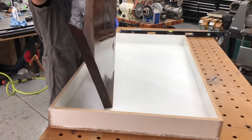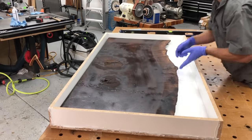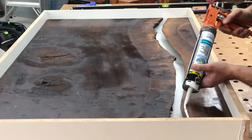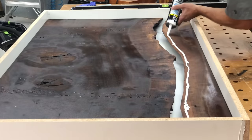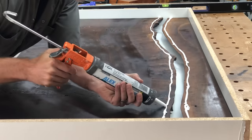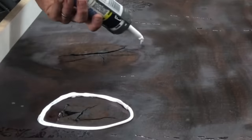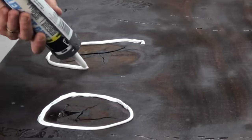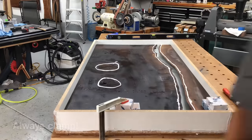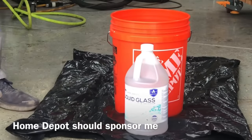I haven't made as many tables as the Black Forest guys, but I've probably made about 50 of these and I've sealed every single edge and not one of them has even had a tiny crack. I am super diligent about cleaning up all the softwood and removing anything that could compromise that bond and getting a really good scuff. So I personally haven't had any issues. I have had issues with staining, so that is why I still opt to seal my edges. In the end it's going to be up to you, but I seal my edges and make sure to get a really good scuff or pour while that seal coat is still tacky.